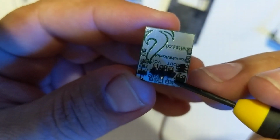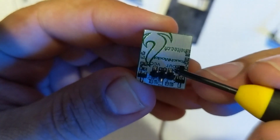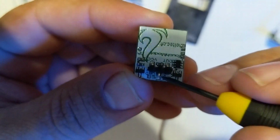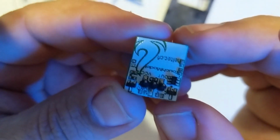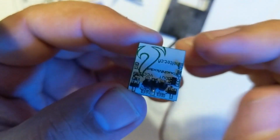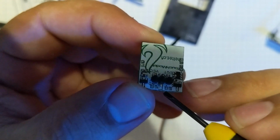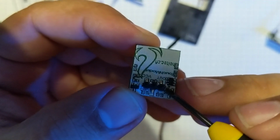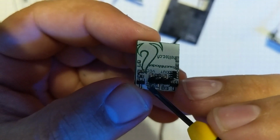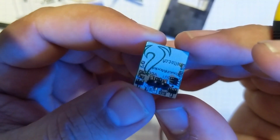So we have officially separated this output from the transistor and the pin and the LED. The LED is officially separated. Now, the tricky part is we need the 4th wire to reattach to the LED. The output pin remains the output pin, nothing of that changes. So what we need to do is add a wire to control the LED.